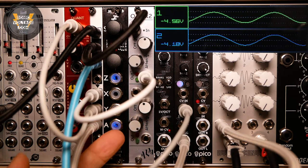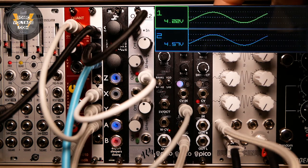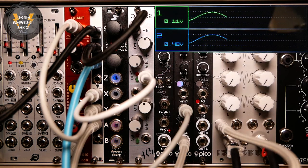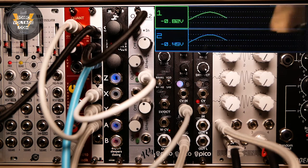For example, you could have another LFO controlling the cutoff frequency of the sound, and you can change the span of the frequency by attenuating it, adding offset, and this way you have control on the range of notes played and the cutoff frequency on the actual sound. But again, as I usually say, it's all about voltage. If you can control and manipulate voltage, you gradually will come up with more and more ways to use this control you have over what happens inside your Eurorack case.